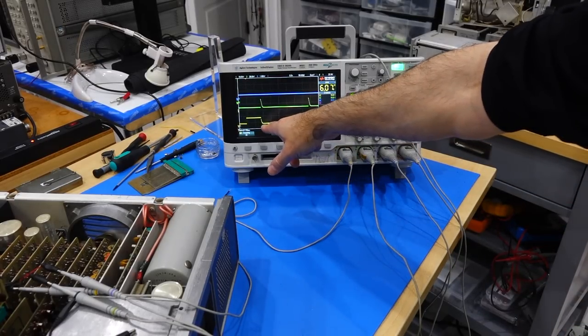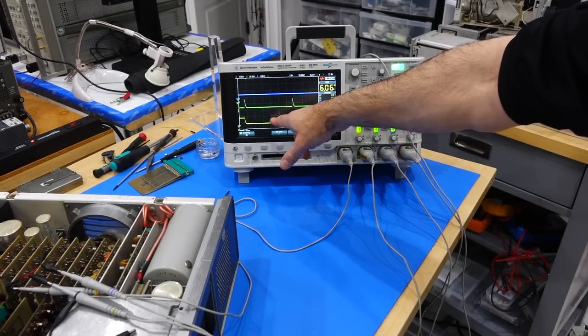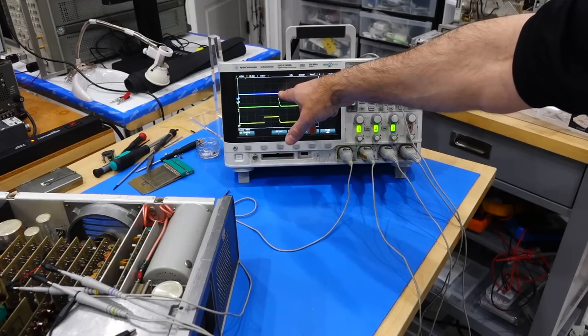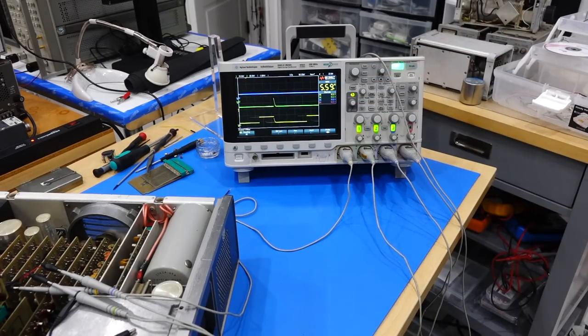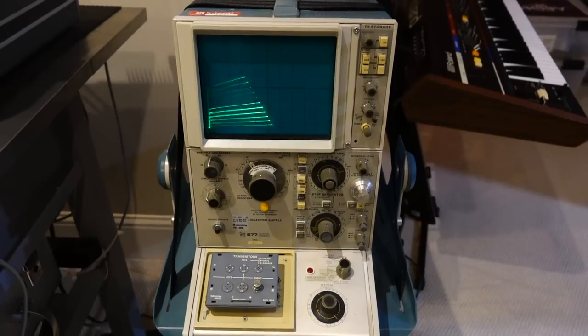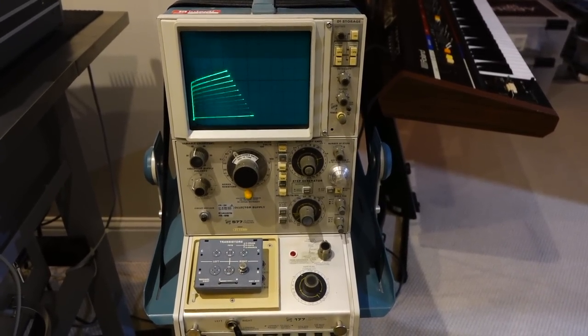So I have the pulse coming out of the multivibrator, I have the reset pulse generated by the first transistor, and I have nothing coming out of the last transistor, which is the reset amplifier. So maybe yet another busted transistor. And guess what? Our reset transistor is a beautiful transistor. So it's not the reset amplifier,